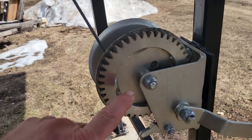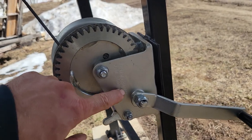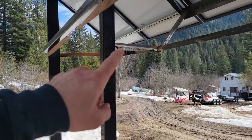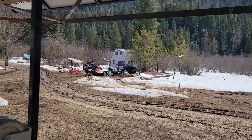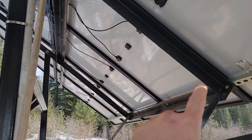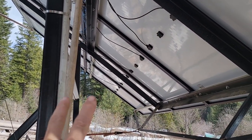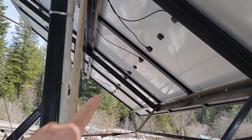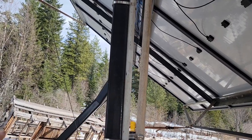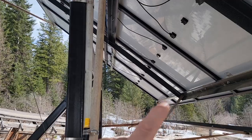This was a cheap Harbor Freight boat winch rated for 1,000 pound capacity. I put a little bit of tension on this cable and pull it against my straps. I plan on making a bar right here that I can adjust twice a year — it'll have two positions: attached here with two different locations where I can unbolt it, tilt the panels down, and bolt it back up — one position for winter and one for summer.